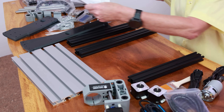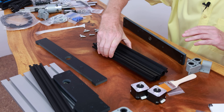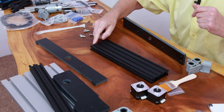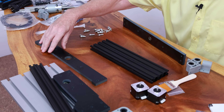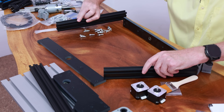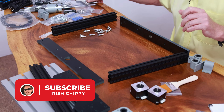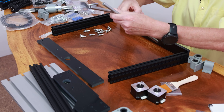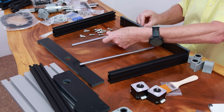We're going to go into Part 2, which is assembly — base installation — and it tells you what you need. I'm going to put it together the way they show it. Before you go further, measure 46 and a half millimeters along both of these and put a line on the outside of the end with the big hole. So that one goes outside like that and that one goes outside like that. Now we're going to put some screws in and get the short bars, and screw them in on one side by hand.